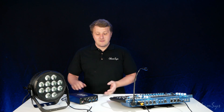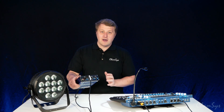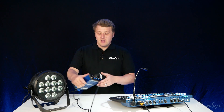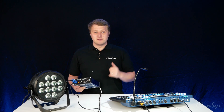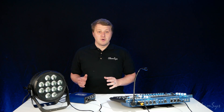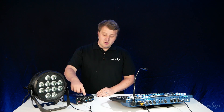The B4 has several operating modes and supports both ArtNet and streaming ACN. Using the mode switches on the front, I'm going to put DIP switch number 4 up only, which puts the device into ArtNet mode as per the descriptions underneath the unit. On the back, my rotary encoder wheels are set to 0 and 0, meaning subnet 0, universe 0 — so it will start decoding from ArtNet subnet 0, universe 0. The ports are assigned sequentially: with 0/0 set, port 1 is ArtNet universe 0, then 1, 2, and 3, running sequentially from the start address set on the wheels.